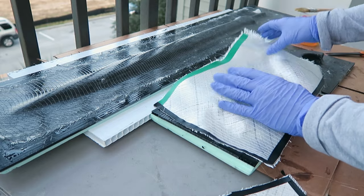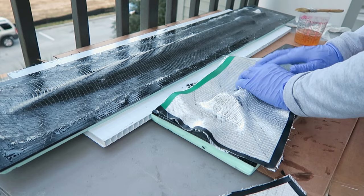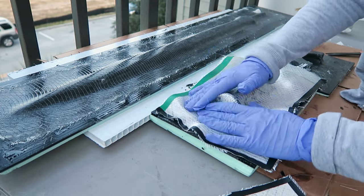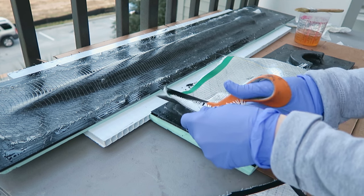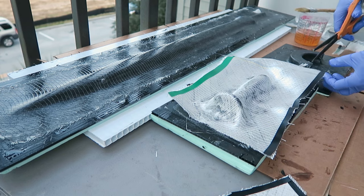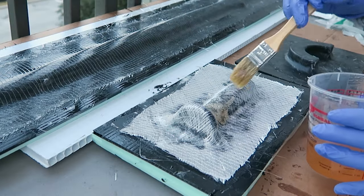The fiberglass layers are progressively heavier to bulk out the mold and ensure that it's going to be rigid and not deform when the parts are under vacuum when we're casting them later on. Depending on the type of fiberglass, various levels of relief cuts are needed. Some conform better than others. Also, the more complex shapes require a bit of finagling to ensure that the fiberglass covers all of the parts and all of the recessed areas are properly reinforced.